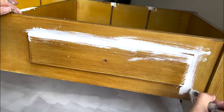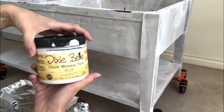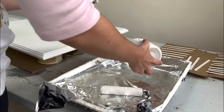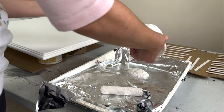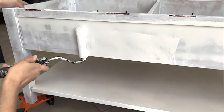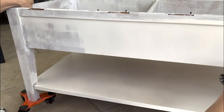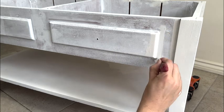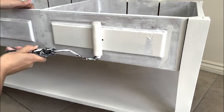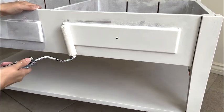The paint I went with was a colour that I see people use all the time but have never used for anything significant myself — the white called Fluff from Dixie Belle's chalk paint range, essentially one of their pure whites. I chose it because I thought it would look really beautiful under the transfer and also give this slightly sad and boring coffee table a really fresh and clean look. For the more detailed areas around the drawers and the bottoms of the legs I used a brush and then smoothed it out with a roller for a nice clean finish, doing three coats to get that really solid coverage.